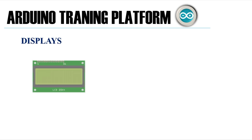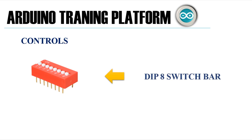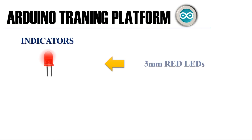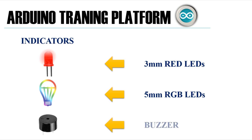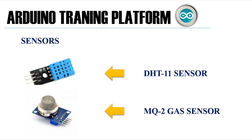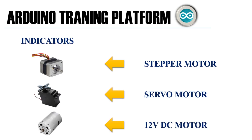I've used some displays like a 20x4 LCD display and a seven-segment four-digit display. About the inputs, we have an eight-switch bar so we can control some indicators, plus two dual-axis joysticks that each have a push button. For indicators, I've included eight red LEDs and two RGB LEDs, and also a buzzer which makes playing with this platform more fun. The sensors include a temperature and humidity sensor and a gas detection sensor. For the actuators, I decided to insert all types of motors — a stepper motor, a servo motor, and two DC motors.